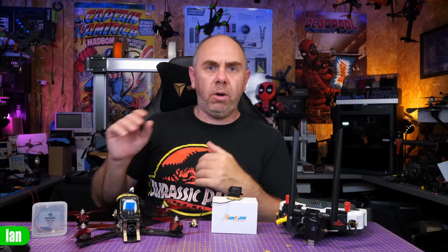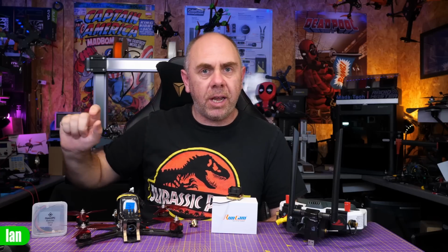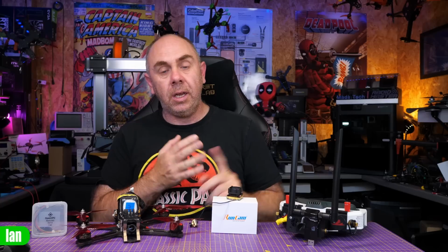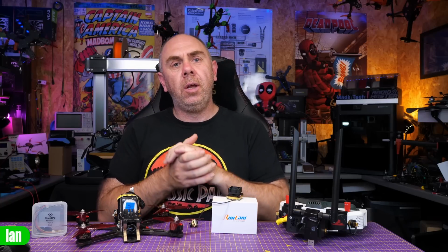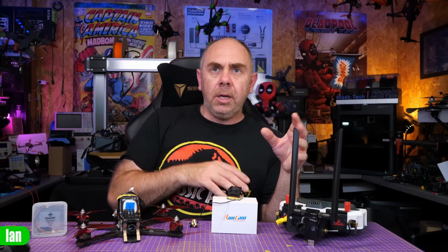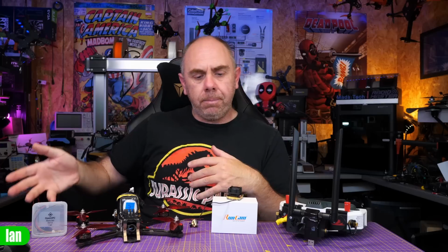There really isn't a sort of starting point, ground zero today, a point where everyone should start here and they will all get the same results. Due to the way we've got different pieces of hardware appearing and the way the system is just so configurable, your results will heavily depend on the settings you use. And it's not just about the frame rate, the camera settings, it's about the MCS rates that you choose, bandwidth, things like that. The system is somewhat infinitely configurable today, and that's great, but it also comes with a downside, because the downside is there is no good middle ground starting point.